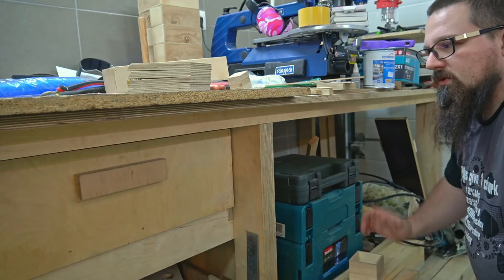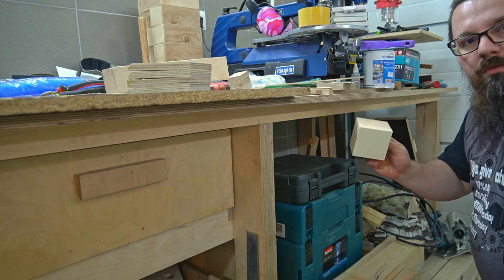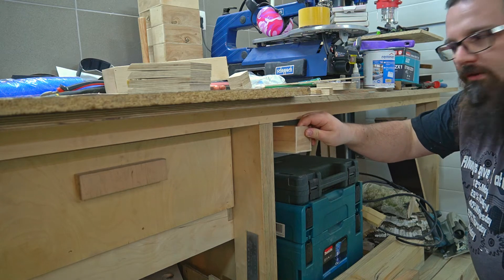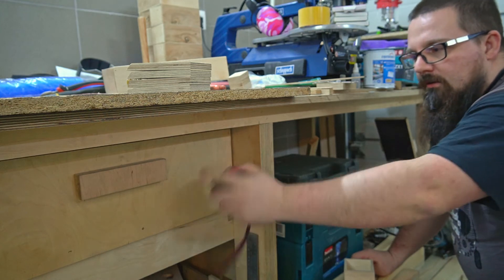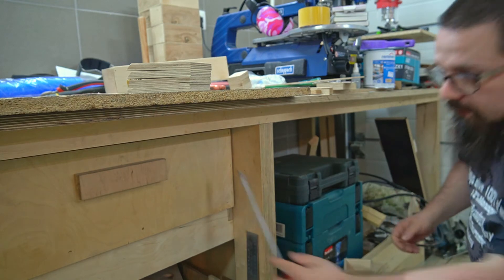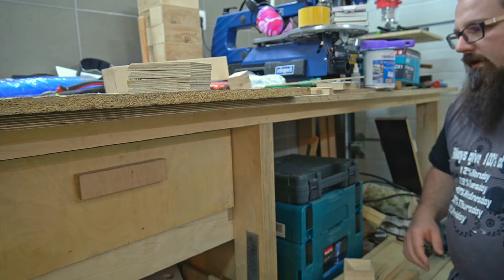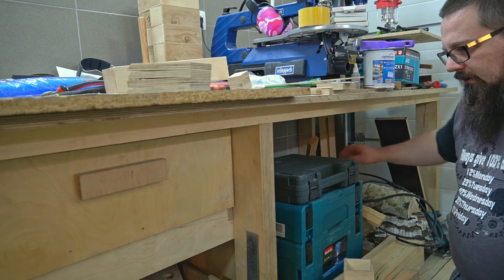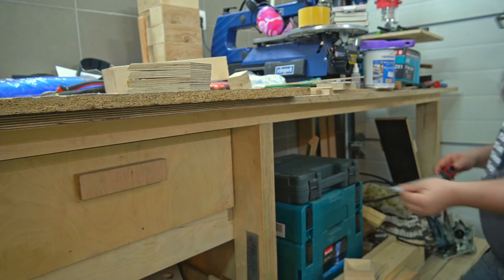What I want to do is make a drawer for my wooden boxes. Those boxes are 6 cm height, so the drawer should be more or less 7.5 cm. I've got some drawers here for my sanding papers, some paints and all this stuff, but they are 20 cm height — too high. That's my storage for scraps and it will stay like this, just a little bit smaller. So what we need to do is to measure the span.